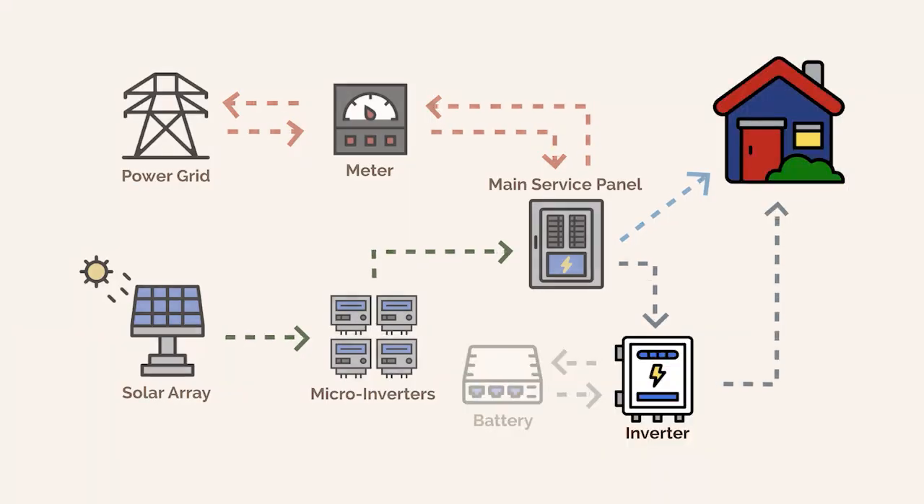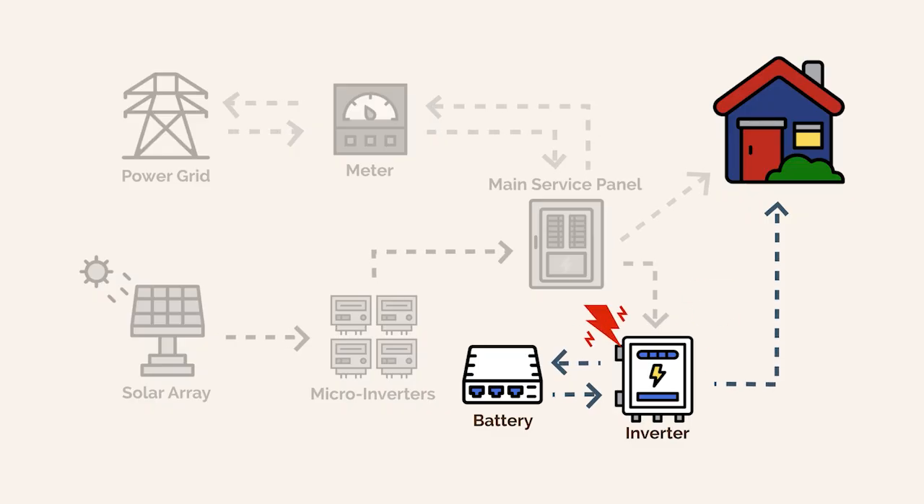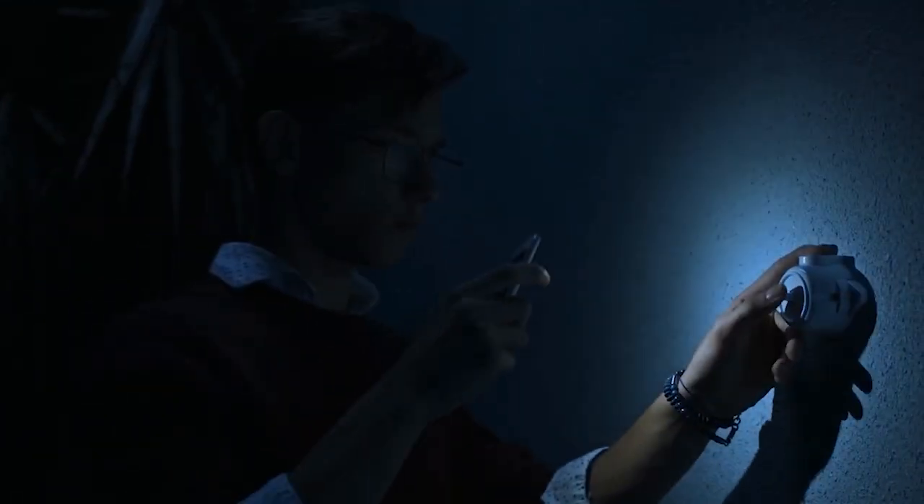So let's say the grid drops — what happens then? Your inverter instantly transfers over to battery power and tries to keep up. It exceeds its 12-kilowatt continuous rating and then shuts down to protect itself. Now you're in the dark with a super expensive inverter that's basically acting like a giant breaker. Even if the inverter could somehow handle it, your battery bank probably couldn't — drawing that much power off-grid without massive batteries means you'd drain your system in hours.